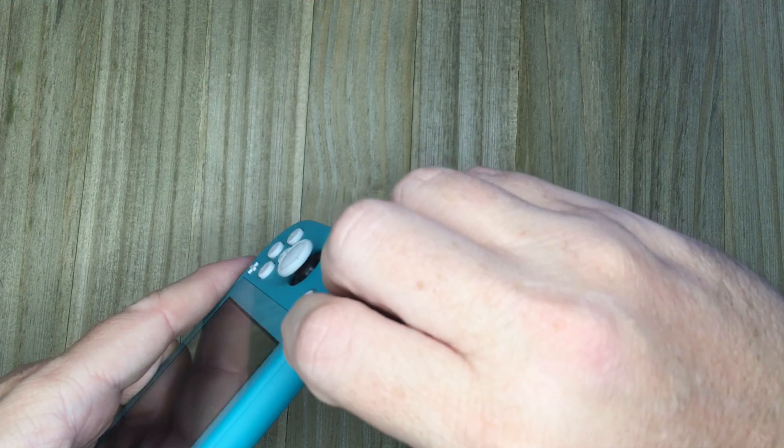If I flip it around to look at the other side of the connector, that appears to be fine. But those three pins are definitely smashed and are definitely going to be a cause of this thing not charging and not powering up. Replacing the charging port itself probably won't be too big of a problem. The bigger question is whether those caused a direct short that damaged some of the internal ICs like the M92 chip or the BQ chip. If those are shorted we'll have to replace those ICs as well.